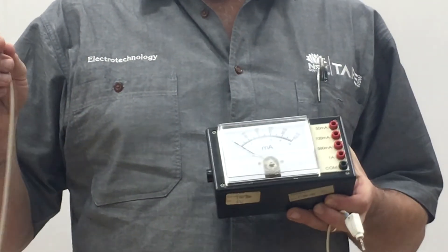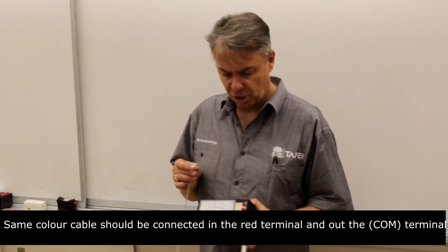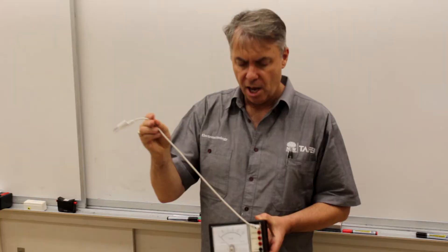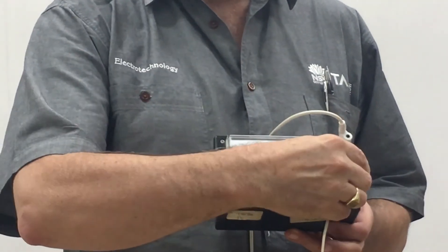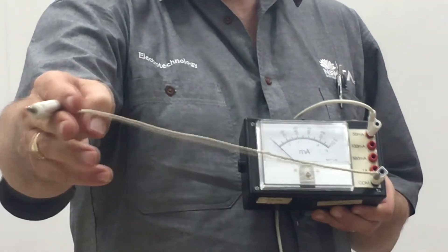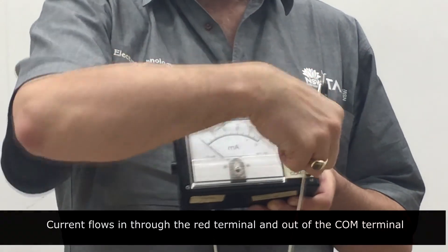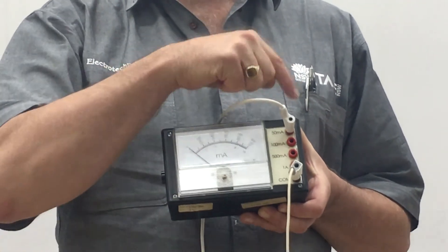With the ammeter, a cable goes in and another cable comes out — we need to break the circuit. The cable going in should be the same colour as going out. We normally put the ammeter after the switch, with a white cable going into the positive terminal so current flows from positive into the ammeter, and out of the common terminal to the rest of the circuit. Keep in mind: current flows in through the red and out through the black.